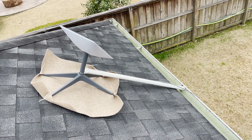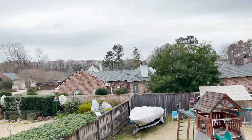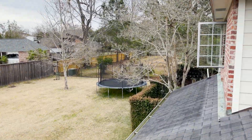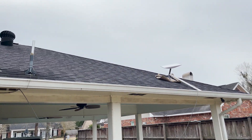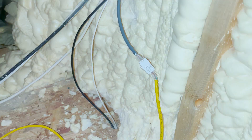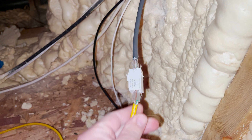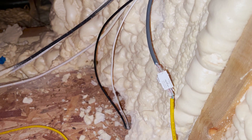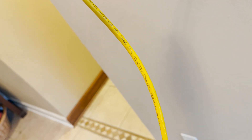So before I cut another hole in my roof, I get the default stand, use some of that carpet and some zip ties and a piece of PVC to secure it to the roof temporarily — I don't want the $500 satellite dish falling to the ground. We weren't expecting any inclement weather, so it was pretty safe. I moved the satellite farther away from the router, but because I had put an RJ45 connection on the satellite side of the cable, I was able to pull that cable back out and use a Cat6 cable from Monoprice. Here are the technical specs for anyone who wants to know exactly what it was.